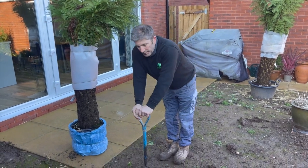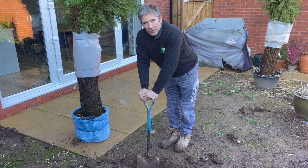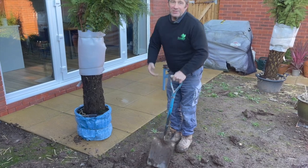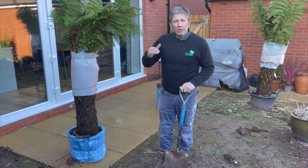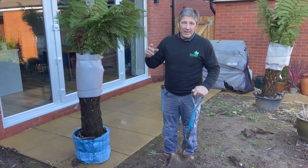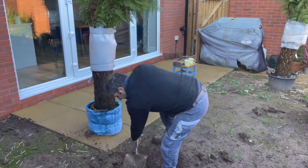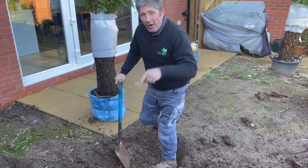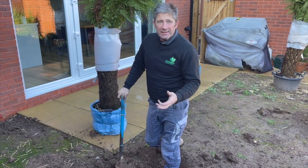So when we talk about depth of dig, people always ask what you should have for a pedestrian area or a patio. Generally the consensus, if you look at forums and standards, is 100 mil sub base, then your bedding course, 1.5 to 2 inches, and then your slab, so it's about 8 inches. But like I always say, the depth of the dig out will depend on the dig. The depth of the sub base depends on the dig.